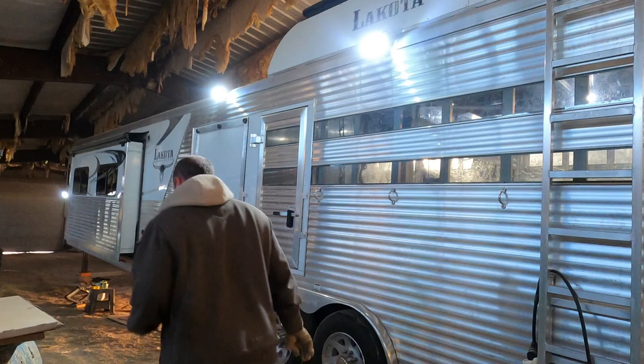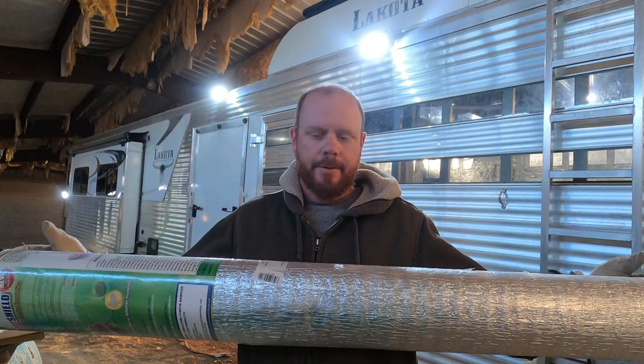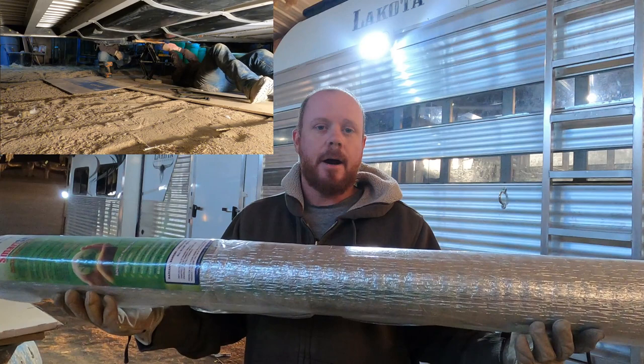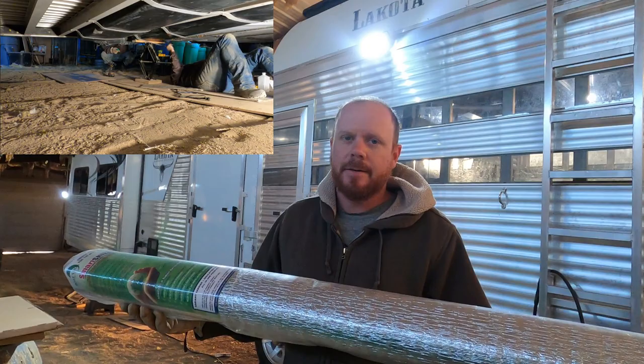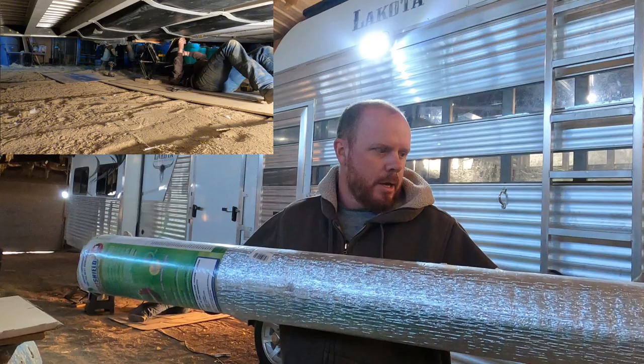Let me show you what that looks like — it's a radiant barrier reflective insulation, a 4x10 roll. We'll probably use a good majority of all of that on each tank, and we have two rolls. The goal is: once we put the heat strip in, we wrap this around it and it creates essentially like a hot pocket, keeping the heat inside the insulation and heating the whole tank to keep it from freezing. We don't need a lot of heat, just enough to keep it from dropping below 32 degrees. I think my plan will work.